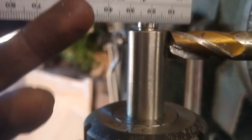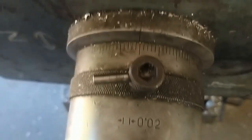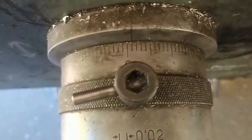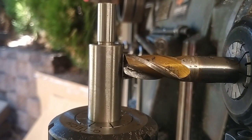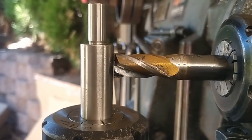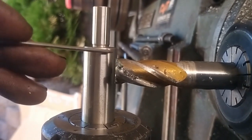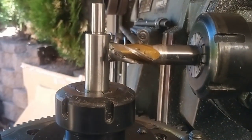I've levelled that off, and I'll come up 5mm. One turn. Two turns. Our aim is to put a 7mm flat on this, and we're at 22.22mm. Sorry, 19.05. Okay, so we've offset this on the y-axis to give ourselves room. We've come in roughly a couple of millimetres, and we'll take our first test pass.